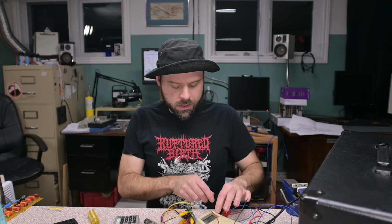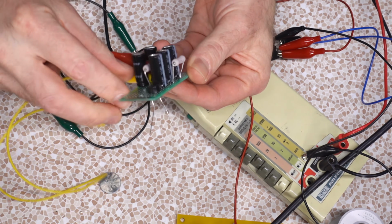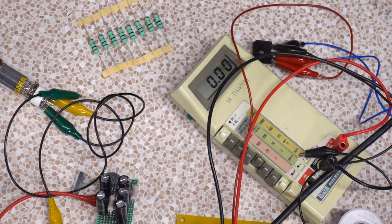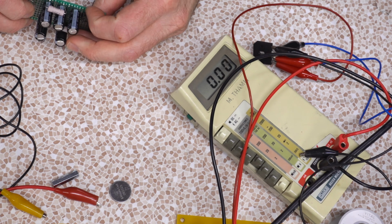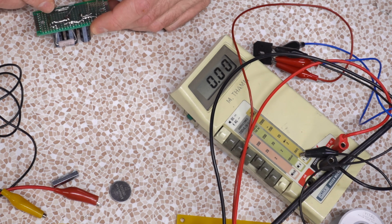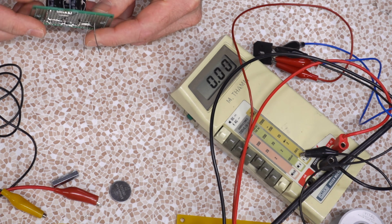If you have to change something, it's a good thing I left these leads a little bit long so I'll be able to repurpose those resistors. Lucky for me, I got a bunch of 1 ohm metal oxides in stock recently. Geez, this DC board project's just definitely gone awry. Ugh, I really spliced them on there. It's probably easier to clip them out and then stick the next resistor in right next to the original contacts. Oh well, more sacrifices to the gods.